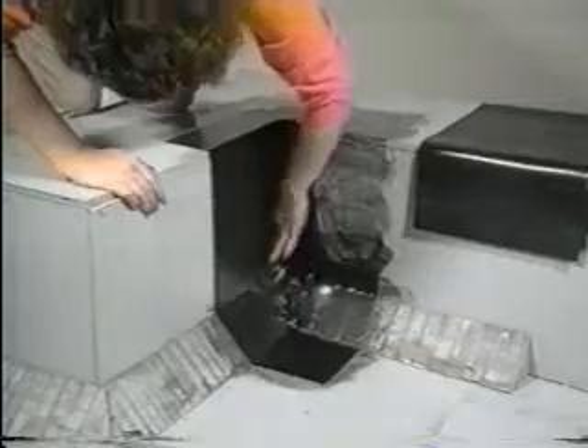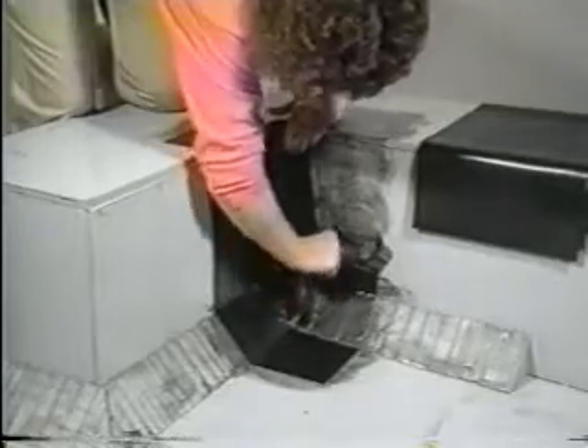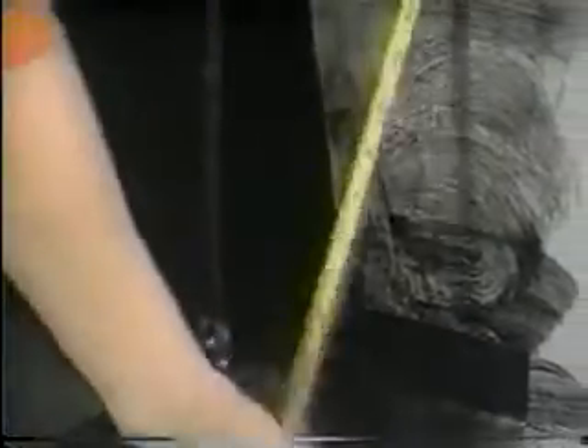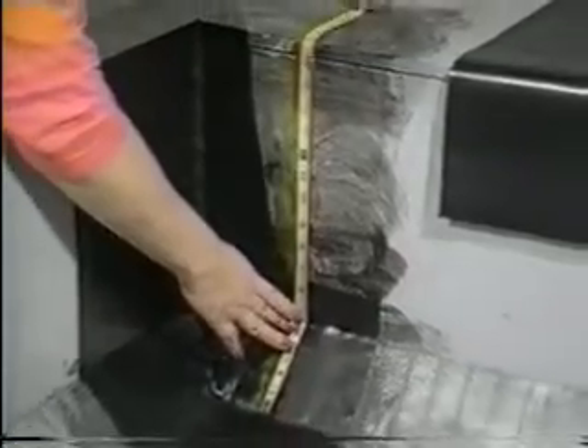You may need to use a heat gun to ensure the top area folds easily. You may also need the heat gun to fill in all the areas where bridging may occur. Next, cover the pig's ear with a straight piece by measuring a 6-inch piece up the side and over the edge.